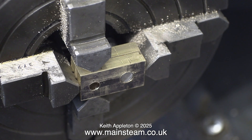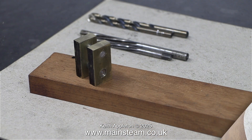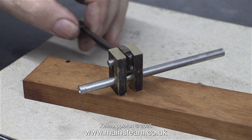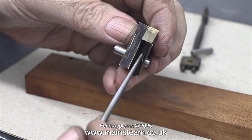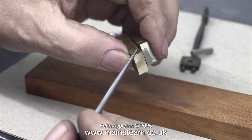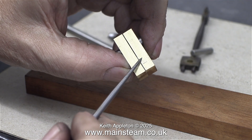The click you've just heard was me turning the contactor off to kill the power to the lathe because the job is basically finished — for now anyway. Here I've pushed some quarter of an inch diameter stainless steel and some 3/16ths of an inch diameter stainless steel into the holes and they fit perfectly. As you can see these crank webs are far too big — I've temporarily fitted the actual connecting rod and that shows it up to be so. The main thing though is the assembly is fine; these marks are unimportant because the outer side is going to be ground on a belt sander.